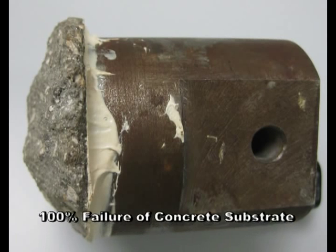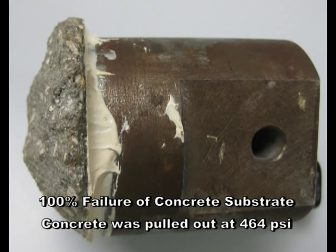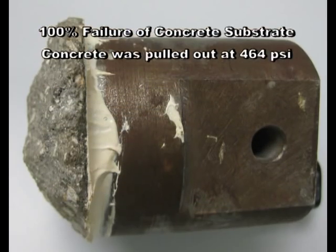Because they are formulated from epoxy, InfraGard and Chim Coat have superior adhesion strength to nearly any surface. Look how the mandrel, bonded to a concrete substrate with InfraGard Top Coat, has literally pulled a chunk of concrete from the substrate in the adhesion strength test.